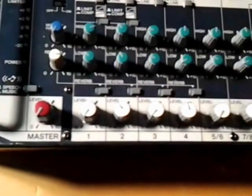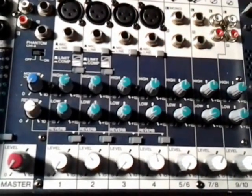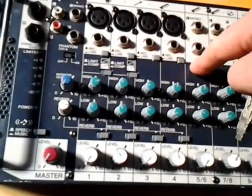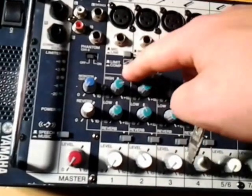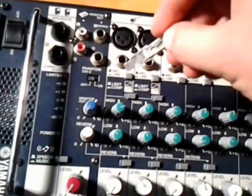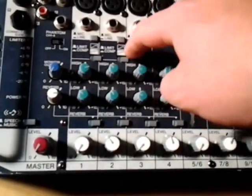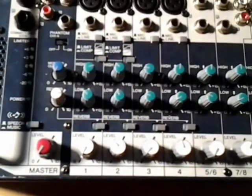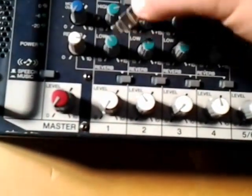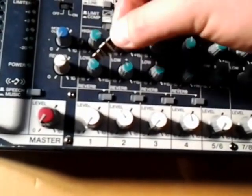You have master and all your volume keys. You have four XLR inputs, which is cool, with a line switch on all of them. Sometimes when you use a line the signal is weak, so you push this button and it just boosts that bad boy. You have two compressions — standard Yamaha compression unit. You just push it in and it gives you a nice compression. I use it for my guitar and vocals, especially when somebody wants to do a speech at a wedding. Basic EQ, high and low, which is stunning because the preamp is amazing so you don't really use it that much.